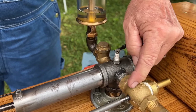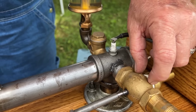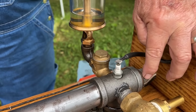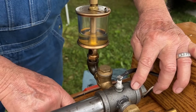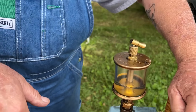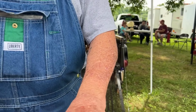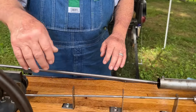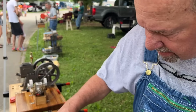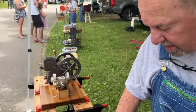That's a cutoff valve. I've modified it and drilled straight through it and put a rod in it so I could put a valve on it inside here that went down against the seat. This is just a nipple and a plug and a T-valve and a flange and another plug, and this is a swing check valve with a real light spring behind it to help it shut. And an elbow, and these are just plain steel rods. I built this out of half inch steel to mount, and I did buy the gears because I don't have an indexing head to make my gears with.